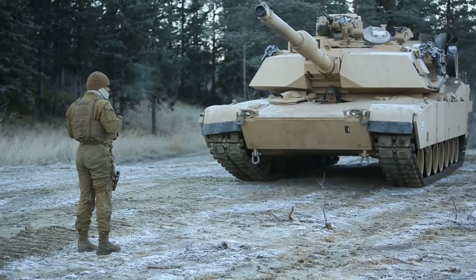The TIS combined with the two-axis sight stabilization allows target acquisition under extreme conditions at much longer ranges than previously known. Neither night, dust storm, nor chemical smoke screens can prevent the gunner from acquiring his target, although fire control systems are extremely expensive, representing about 10% of the total cost of the tank. They proved a real war winner though for the Gulf War, and a program of further improvement is in the works with the M1A3 potential upgrades. Each sight system is protected from incoming fire by its own set of blast doors.